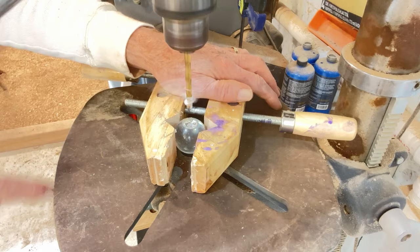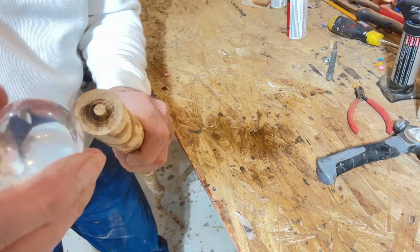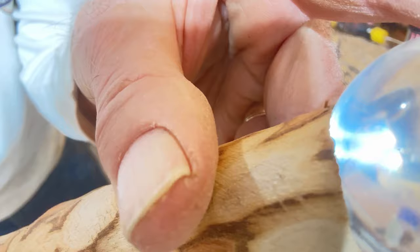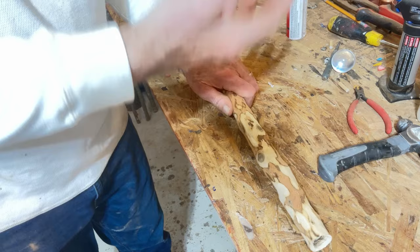That's enough right there — just a little bit is all we want. Now let's take a look. We drilled that hole right dead center. Get that dowel pin stuck in there, then take your ball and set it right down in there. Adjust the length of your dowel till it sits in there real good, with the dowel as an anchor. You can see it goes right up against that ball.